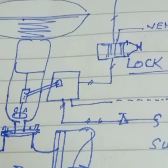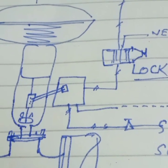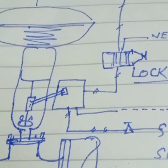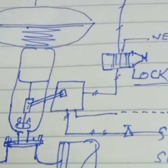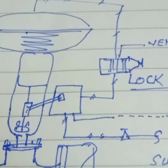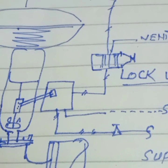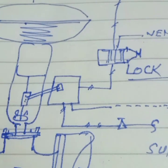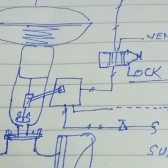When the air supply fails, a double acting air lock relay is used in a pneumatically operated double acting actuator. Similarly, a single acting air lockup relay is used in the pneumatically operated single acting actuator and power cylinders to hold its position in the event of air failure, or in case the air drops below the preset pressure. The air lock relay is connected between the positioner and the actuator.